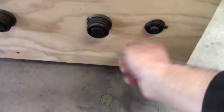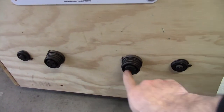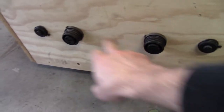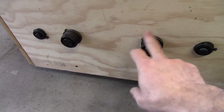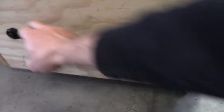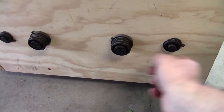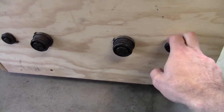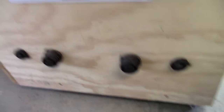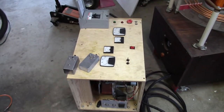These are the connectors — industrial connectors, actually waterproof, which this box is not. This is for the main power for each of two Tesla coils to run the inverters that actually drive the coil arcs. There are 120 volts and 12 volts coming out to drive the controllers inside the Tesla coils themselves. That's just a quick rundown of the power supply for the coils, and we'll show you more when we get into building the coils themselves.